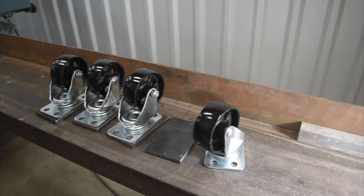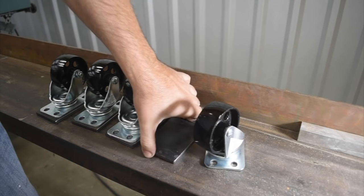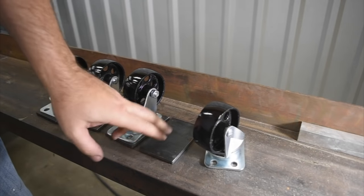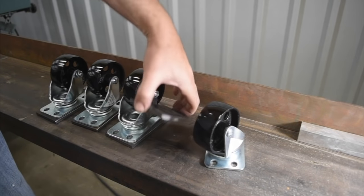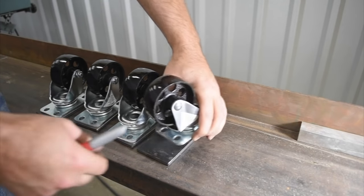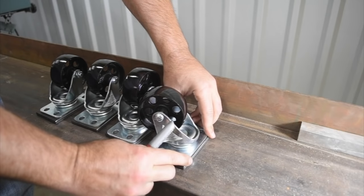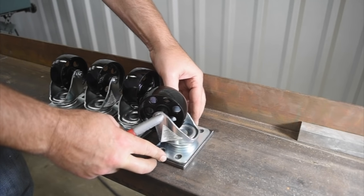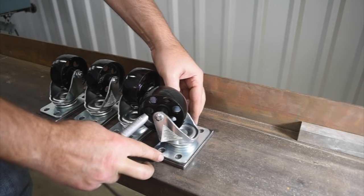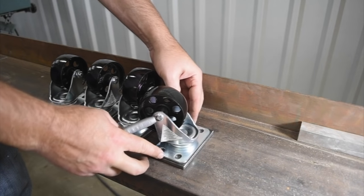Here's another common use for this kind of thing: if you have square or round steel parts that you need to drill or put holes around the perimeter in a consistent pattern, it can be done really easily with this hole punch. We've got to make these caster plates for something else we're building, and these are quarter inch. We've got four of them, 16 holes that we've got to cut out. One of the important things you need to do is make sure all these are measured and cut to the same length, and you also have to do a really good job of getting this centered exactly. If this is not centered, this will not work properly and your holes won't line up.